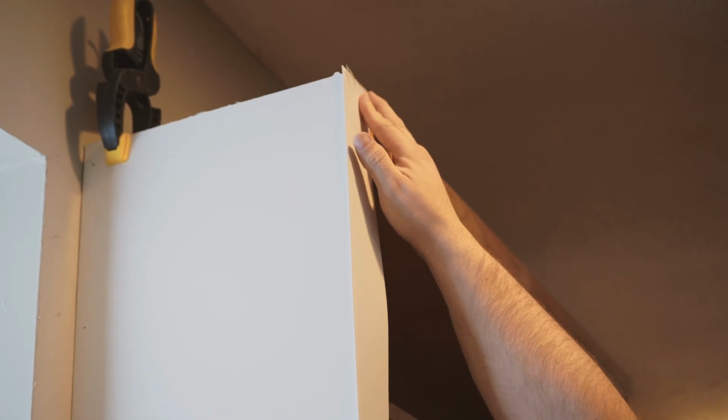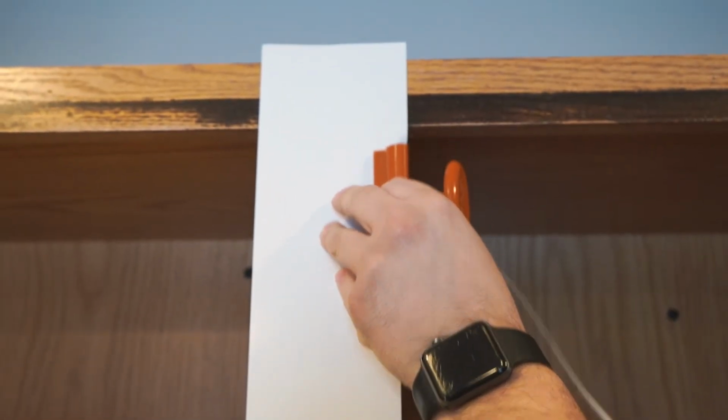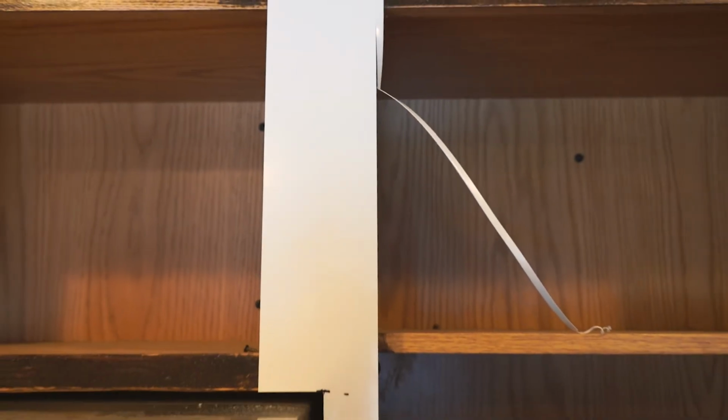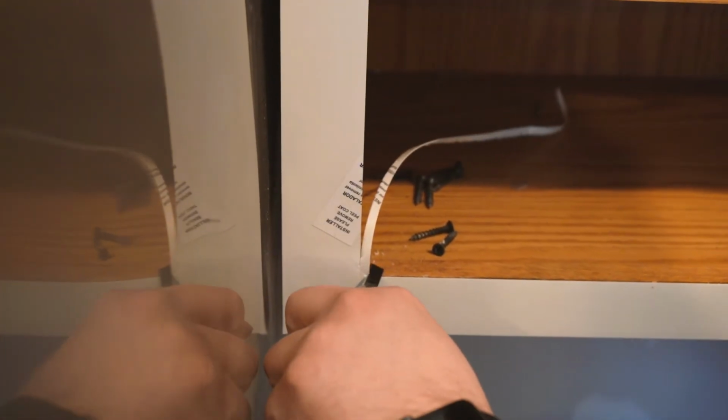After applying the oversized strips of PSA to the cabinet face, use the orange hand trimmer to remove excess PSA. The orange hand trimmer will not cut all the way into the cabinet corners, so you should use a snap blade knife to clean up corners.